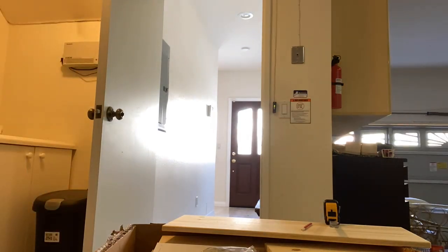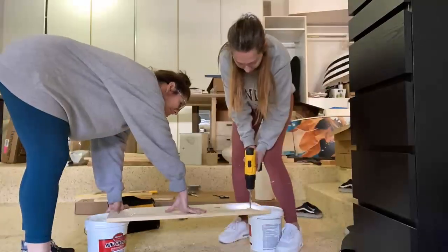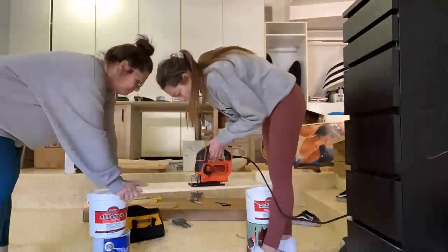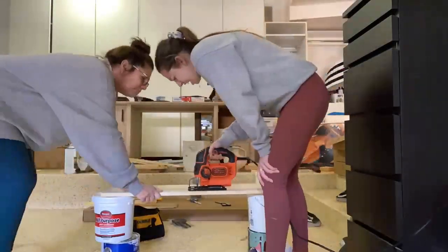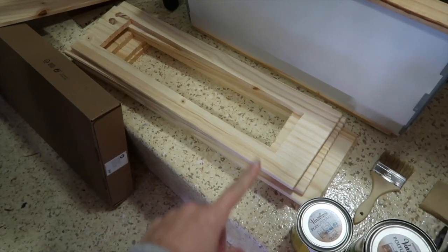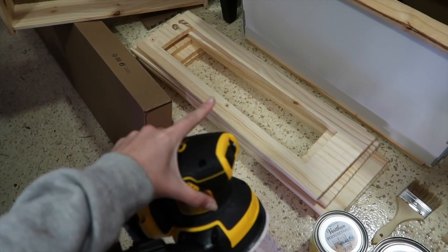Something different about the six-drawer dresser fronts is that since they weren't put together yet, the setup was a bit different for drilling and sawing. We stacked up some joint compound containers — and then stacked paint cans even higher — as an improvised sawhorse since I don't have one. I used the same jigsaw and drill process to saw out the traced rectangles. Once one set of six-drawer fronts was done, I used the sander to smooth all the edges, evening out any jagged spots.